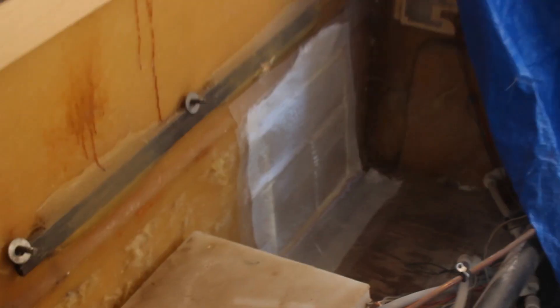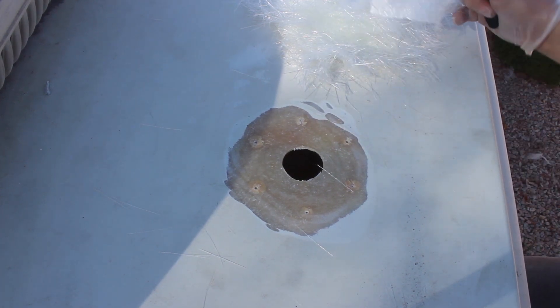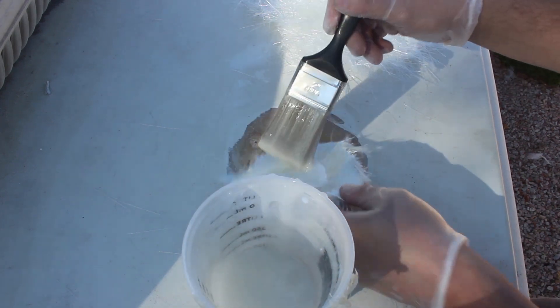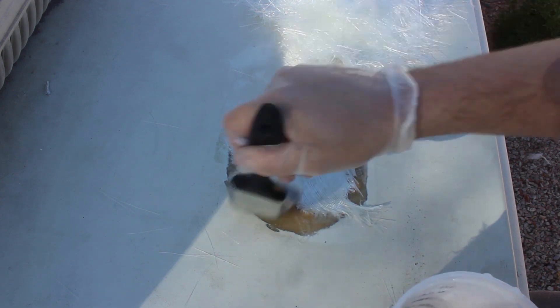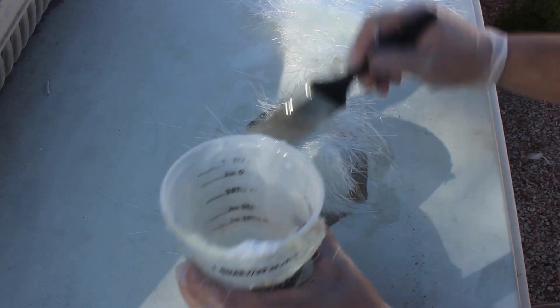First we put these stronger biaxial fiberglass mats over the holes rather than the chopped mats. Excuse the oddly shaped piece of fiberglass mesh, but nonetheless this was an easy fill of one of the holes. As you can see, no wood in there. Got to make sure to put some fiberglass resin on the base there. As you paint it in, these sheets really just disappear — it's really quite magical. From there, just keep layering it up and adding them on and smoothing it out.